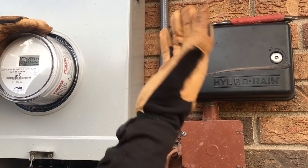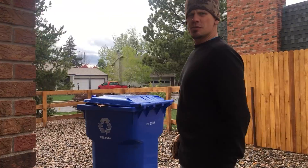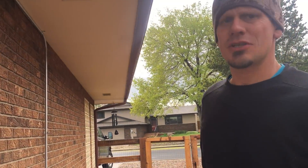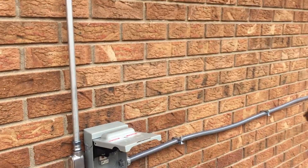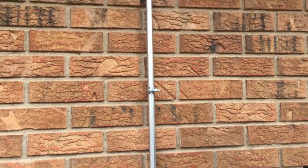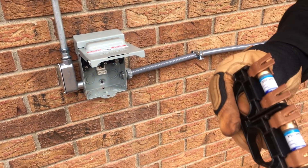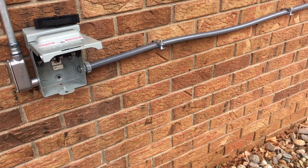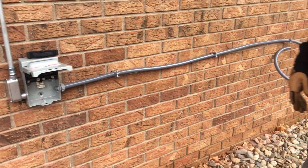We're going to be running wire next for the mini split, which comes across here and down. If you don't know what a mini split is, it's a heater/AC unit — she does crafts in that finished garage. This comes down to here, and again always use fuses — it's a 25-amp FRM. The whip is long enough because we don't know where the AC guy is sticking the condenser; he can cut it back.